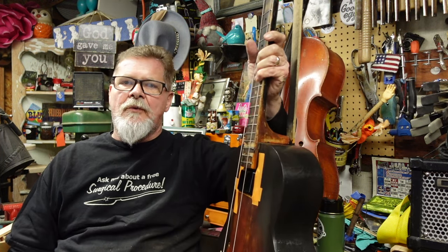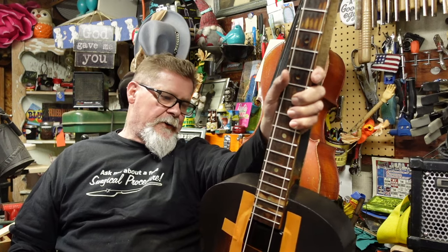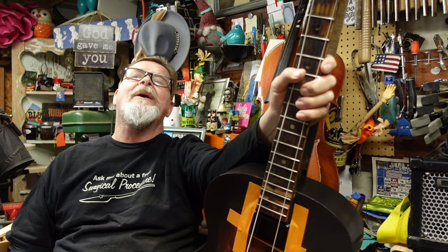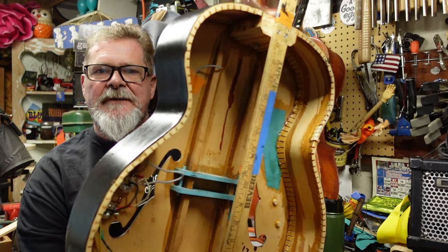And he made the comment that he thought it was very possible that no one ever changed the hide glue vats in the factory, because good hide glue, especially if you order it from a reputable place, you can get it where it dries almost like glass, but the thicker and murkier it is, the worse. He's seen guitars where it was just slopped all over on the inside and it looked like blood running all over the place. Does that sound familiar? See them big streaks right there? I didn't do that. It came out of the factory that way.